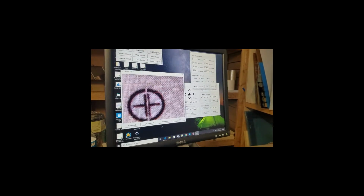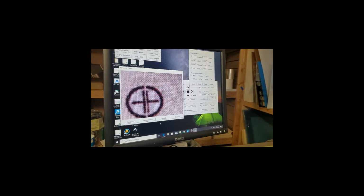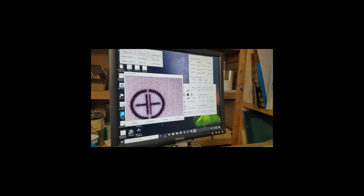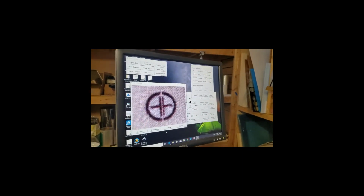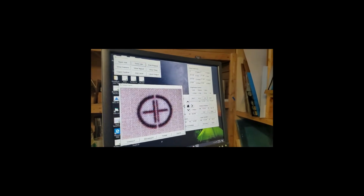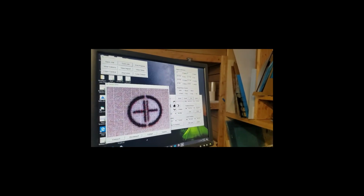And then now it's moving to the Y scaled dimension up, and then I'm going to click on it again, adjust it, right click on it, then the final mark. And you can see all these are off because this job has distortion in it. It can have twist in it, it could be rotated on the table, the scale could be different. All these are going to be factored in. So this last one, when I click on it, it gets all 4 points. It knows how to distort the image and correct for all those distortions.